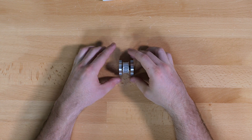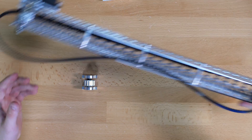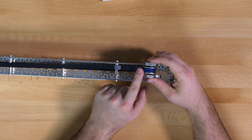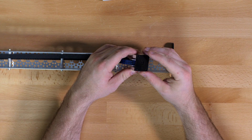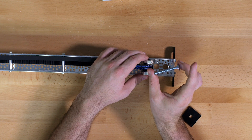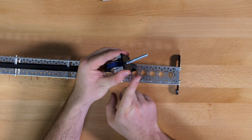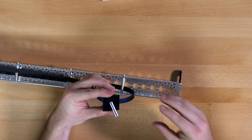If you push it on a little too much, you can pull it right back. Once we have that, we are going to place it on the inside of your belt. Then you will attach it to the black square piece of plastic. Before you do that, take the longer bolt that comes with your kit, feed it through the square hole in the middle, and attach it so that the bolt is facing out away from the rest of the kit. For this part you are going to use the 5/16 inch screws.